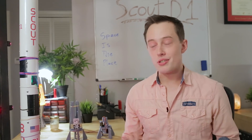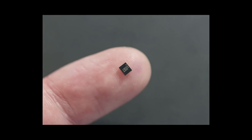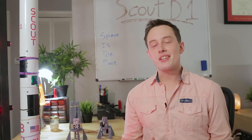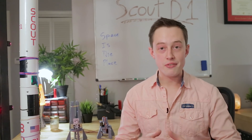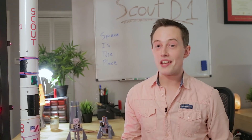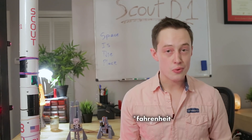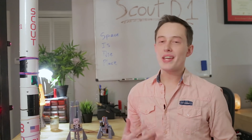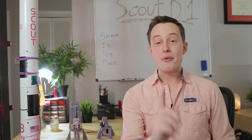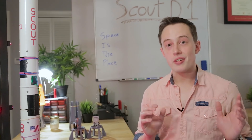You just look for where gravity is pointed on all three axes. However, these are little MEMS accelerometers, which means they're very tiny — the whole sensor package with the accelerometers and gyroscopes can fit on the tip of my index finger. Because these accelerometers are pretty sensitive to changes in temperature and environmental factors, let's give a hypothetical scenario: your apartment in Nashville, Tennessee is 70 degrees, you calibrate the accelerometers inside there, then you bring the rocket out to the launch site where it is 40 degrees. That's essentially where all of this error comes from. While the vehicle is on the pad, it thinks that it's not quite upright. However, this alone is not quite the problem. To better understand where this error comes from, we need to take a look at the guts of the system — the Signal R2 flight computer.